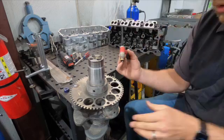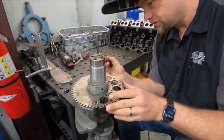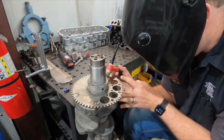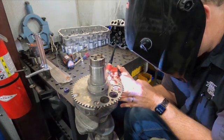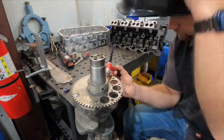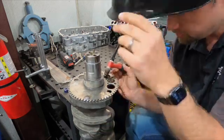So pretty much the same thing. We'll just come over here and you can see I can touch it. I didn't put any heat in it. I was wearing gloves. So I'm gonna do another tack here. Same deal, really lightly, really quick, in and out. One, and we'll do one more. We'll come over here, and we'll do one more.